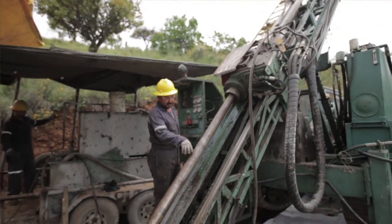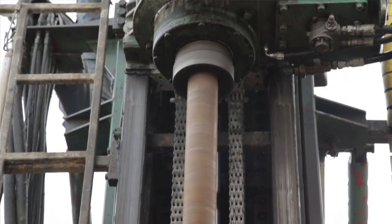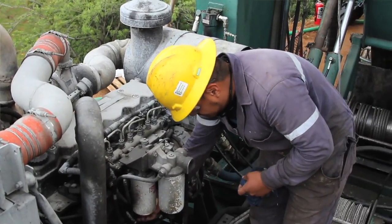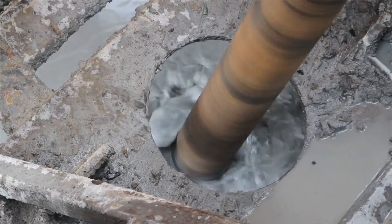Once you've decided to start the drilling process, things ramp up very quickly. There's lots of personnel involved, lots of equipment. It's very noisy, fairly dirty, hard work. The rigs are turning 24 hours a day, so part of the time they're working is in the middle of the night — they don't even stop for lunch. The drill will always run. It's a large diesel engine, and you always smell the diesel fumes. They'll start revving it up just like a motorcycle, getting louder and louder. There's a four-speed transmission just like in a car, and the driller is actually shifting up. When he's further up in the hole with lots of power, he can gear up into fourth gear and run the drill quite quickly so it drills faster.